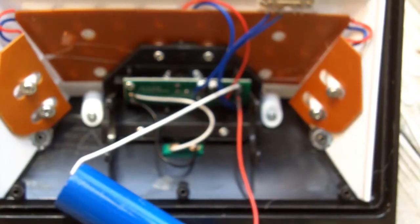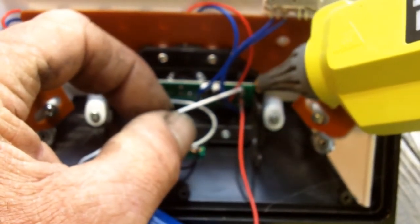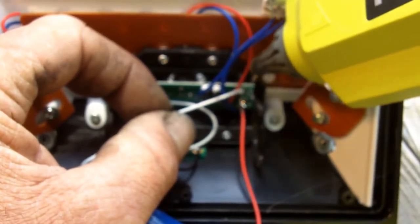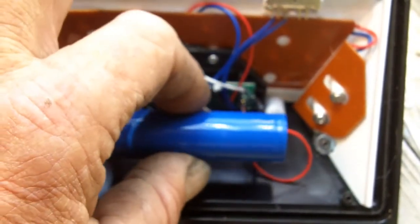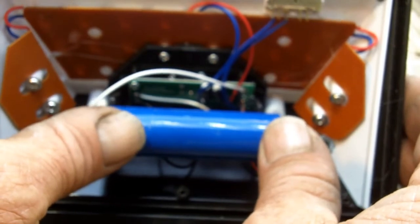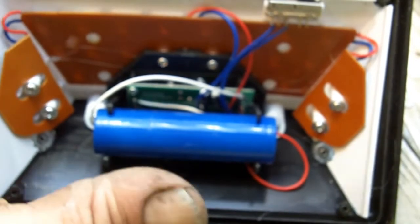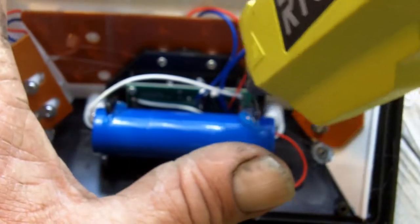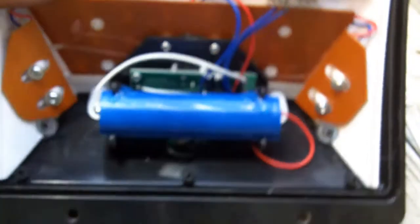So I finished soldering up the wires. And I apologize if this isn't totally clear. Now I'm going to put a dab of hot melt glue onto the joint that I repaired, just in case it loosens up again. It hopefully won't short circuit with the positive lead of the battery which is right next to it. I'll reinstall the battery. A little dab of glue here, a little dab of glue there, and hopefully that'll prevent this battery sliding out in the future. So there's that one done.